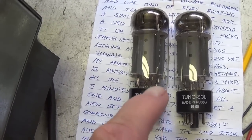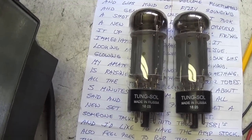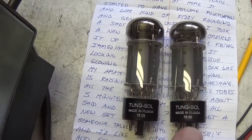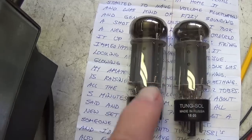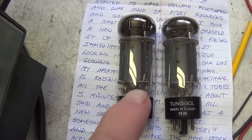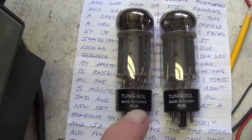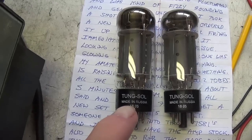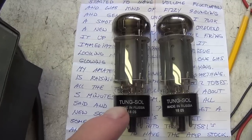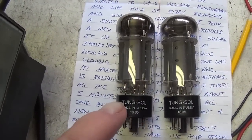And we know that as the bias percentage goes down from optimum, the tone suffers greatly. So I think the issue was the wrong tubes, and then with the completely wrong bias for the wrong tubes. So here's what I advocate. I'm going to order a pair of 5881s for this amp and see if, when they're properly biased, we can't get great tone, kind of a low draw on our power transformer so that it will not overheat, and see if we can't solve this problem.